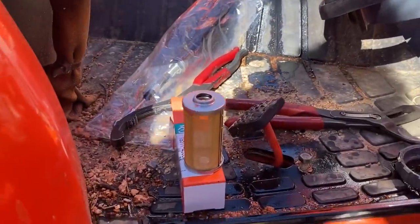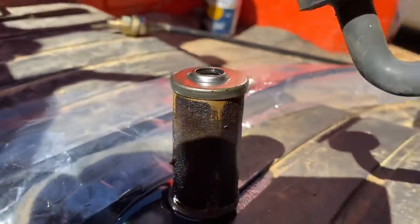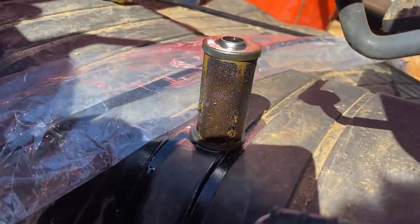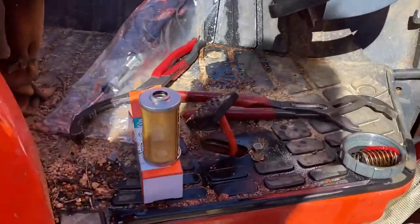Hey Jamie. We're doing the major service on the Kubota tractor here. We're replacing the fuel strainer — you can see the old one was definitely kind of overdue for that, with a little bit of sediment in the water separator part.